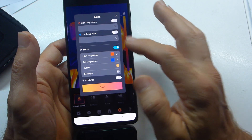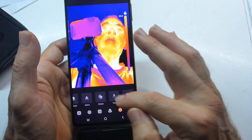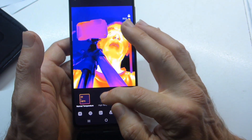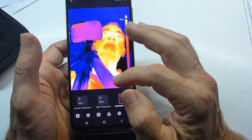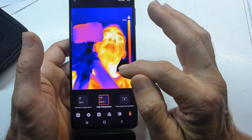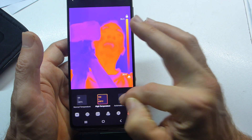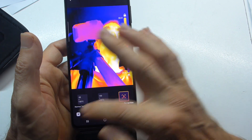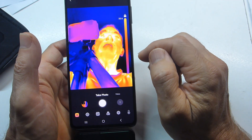You've got alarm points — set alarm high, set alarm low — plus image rotation and mirroring. There are two temperature ranges: minus 20 to 150°C and 150 to 450°C, or automatic recognition which senses the temperature and selects the best mode. In 150–450 mode it really struggles with room-temperature scenes — wrong mode. Back to automatic recognition and it picks up correctly. Then just take photos or video and away you go — that's the module in a nutshell.